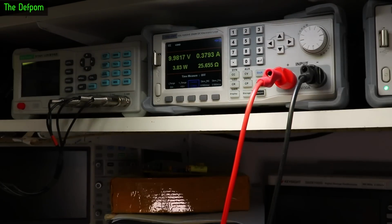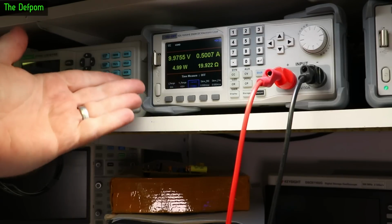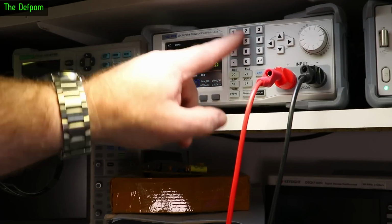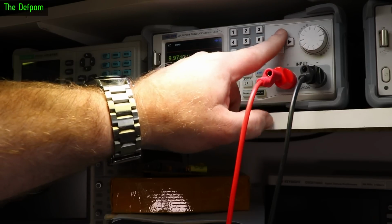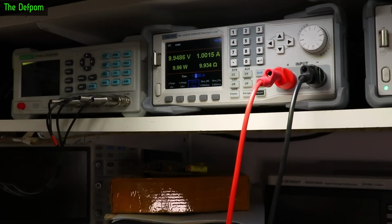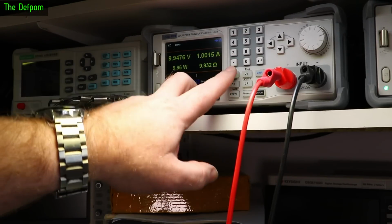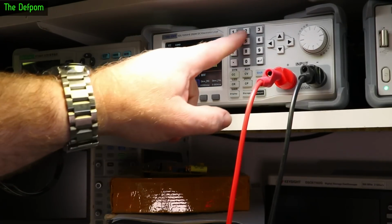Turn the load on. Now you will get voltage drop through these cables, they're not ideal, and they're clipped onto the back. But it's doing half an amp here. The display says 497 milliamps, but it is working. So let's do 1 amp. Come on. So 1 amp, that's working there. Display said 997 milliamps. Again, discrepancy there. Let's do 1.5 amps. That's fine. Display says 1.497. 2 amps.